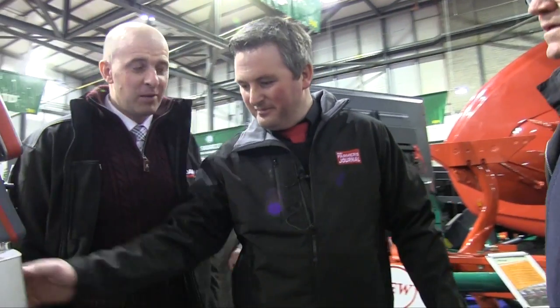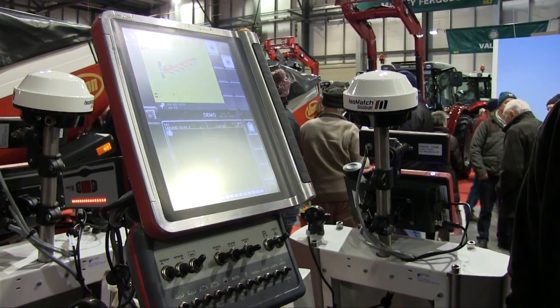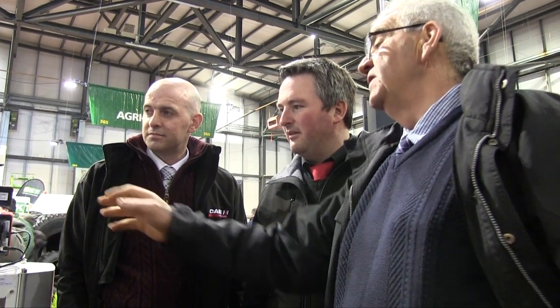Talking about the eye plough — what's the eye plough going to do for us? Supposedly to make life easier. Is that all electro-hydraulics or is it coming through a computer? It's coming from the computer itself but it has an oil flow from the factory permanently, and it's also connected with GPS. So with this plough, if you're running a straight line in the field and you have curves in it, after a few runs it should have the whole field running straight.